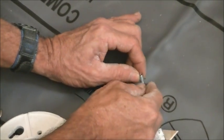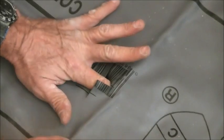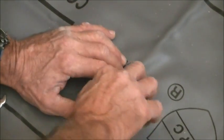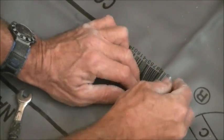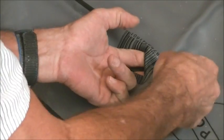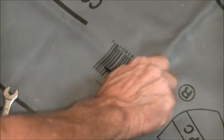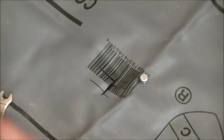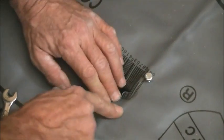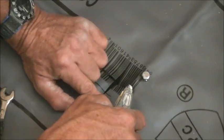The part of the bolt shaft is not as thick as the head, so why would you stretch out your pan liner? The way I do it is I reach up under there with my finger and feel where the hole is, then make a very small X — I want a very snug fit — and push the bolt shaft through that X. If it's really tough to push through, that's better. Then I get it into the hole and screw it down partway, push the excess pan liner around the shaft, and repeat for the remaining three bolts.